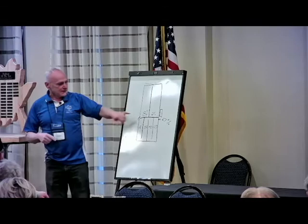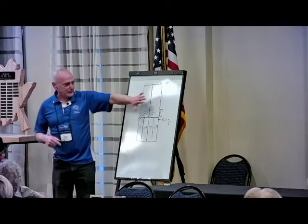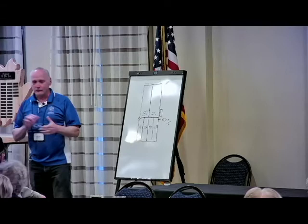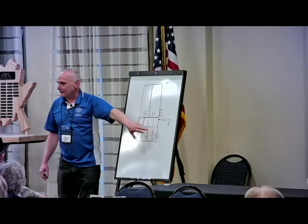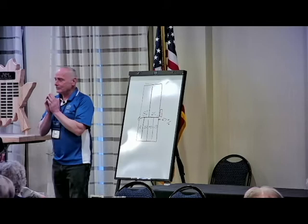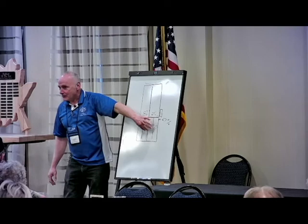But this whole back flue pan, where 75% of the water is removed, by the time it exits this pan, it might be at 8%. So it takes this whole pan to get rid of 75% of the water. That's where most evaporation happens. We come into the front pan, and this compartment might be up to 12%, and then 22, 40, and 65 over here. When it's 67, we draw it out. We want everything to run very smooth and steady. Have you ever been to your neighbor's sugar house when he thinks it's like this, but these two compartments back here might be at 80%?